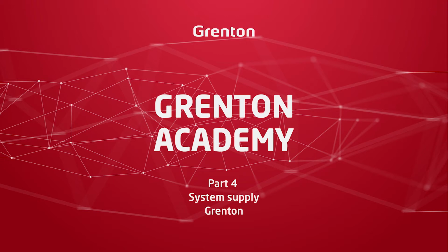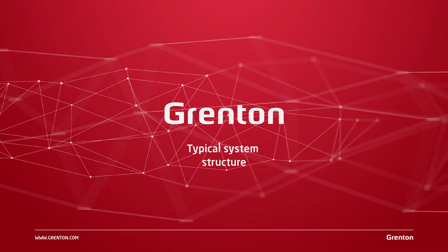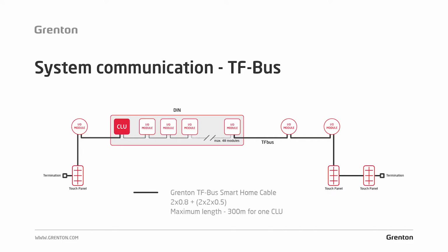From previous videos, you have already learned how to prepare the wiring of the electrical installation for the needs of the smart home system and how to properly make the bus of the Grenton system. Now, as a brief reminder, I would like you to see the slide of a properly made system bus once again. If you remember correctly, the maximum bus length is 300 meters. The bus cannot be looped and you cannot use taps, i.e. we do not use star topology, and you use the Grenton Smart Home cable to make the bus.